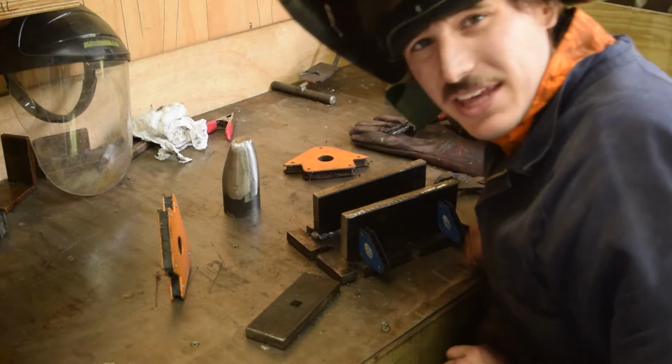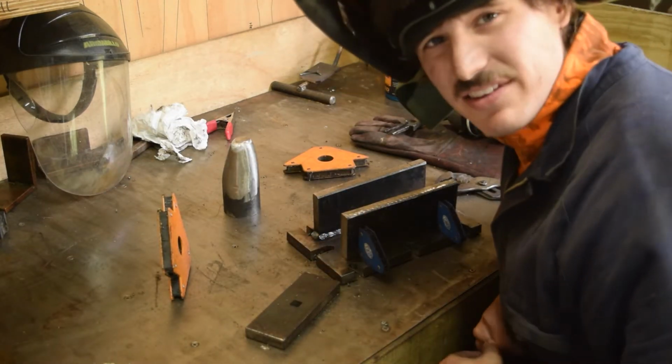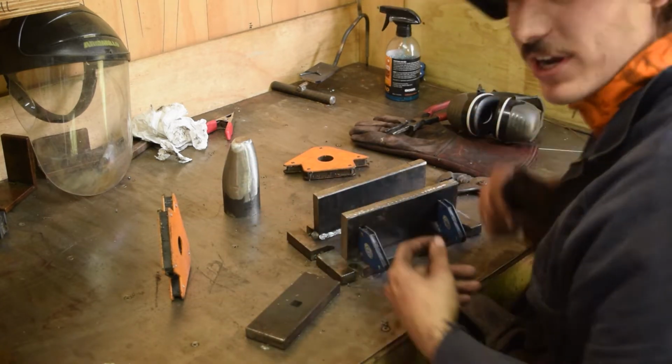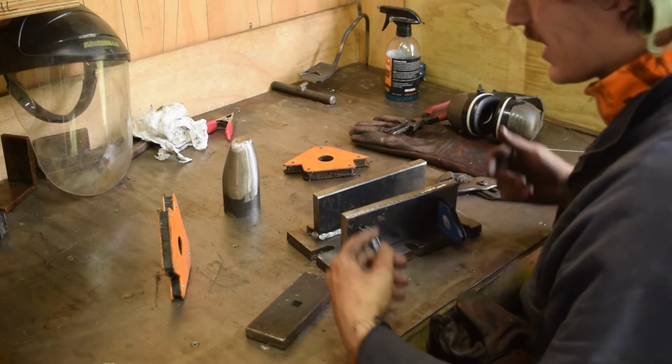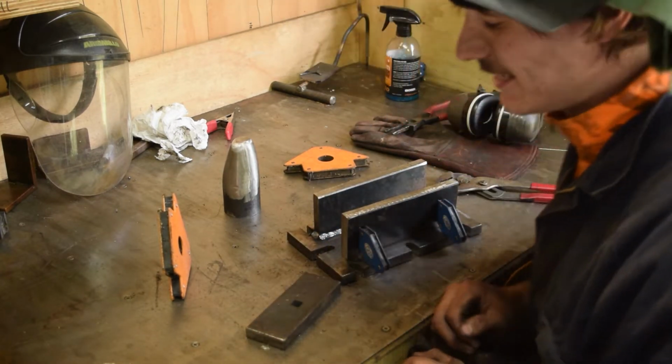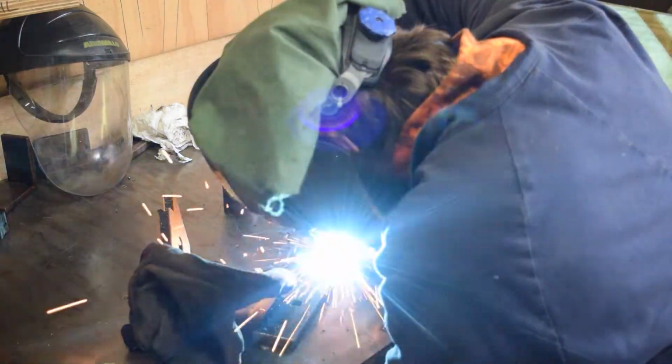Now when you tack something up, if you just tack the two sides, it's just going to peel back and pull out of square. So when you do tacking, you want at least 3 points of contact. But in my case, I've got 4 corners. I'll tack all 4 corners before I even start doing any seaming.